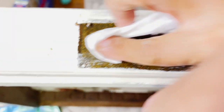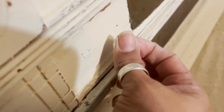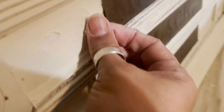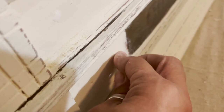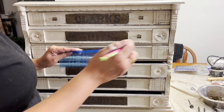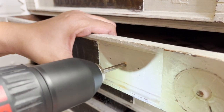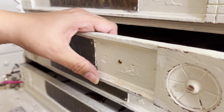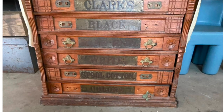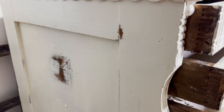I cleaned up the plaques with baby wipes and distressed the piece, doing a little sanding in some sections. I also realized I'd forgotten about the drawer pulls, so I took out my IOD air dry clay and smudged it into the original holes, since my new hardware had single holes. I applied a little paint over it and it worked great. I have a special tool for hardware that helps place it in the same spot. I mark my spots, drill the hole, and then get my husband to help with the twisting motion.